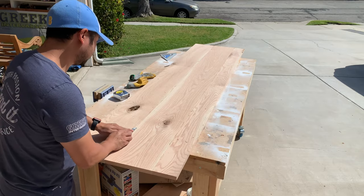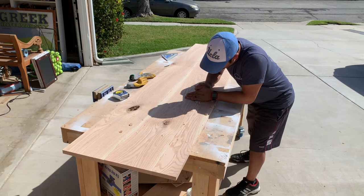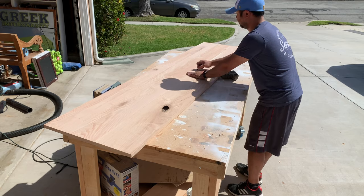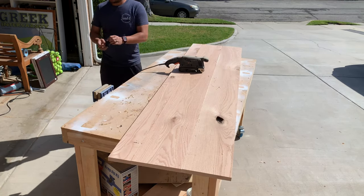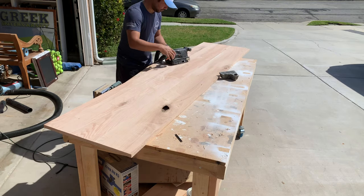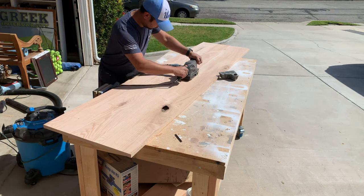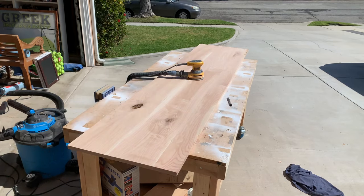Since I had to let the glue dry for all the legs, I went back to the table, took a chisel, and began to get off all the dry glue squeeze-out that came from the glue-up. Next I took a pencil and marked all the uneven spaces on the table where I was going to use a belt sander to level the table. I got out my belt sander, connected my extendable hose to my shop vac, and began to sand like crazy. I probably sanded for a good hour just trying to level the table, and following that I used a random orbit sander. But honestly, no one wants to watch someone sand in a video for a long time.